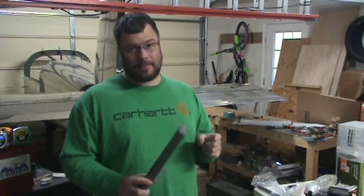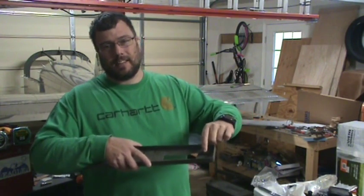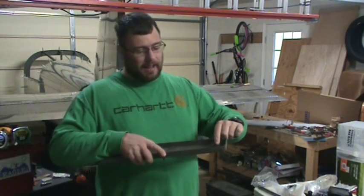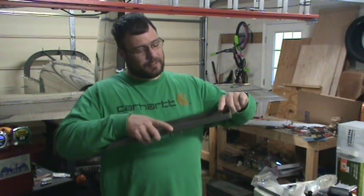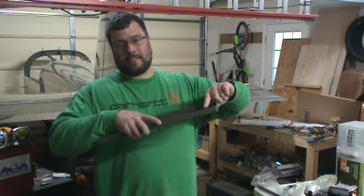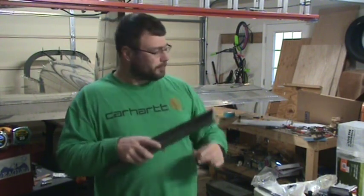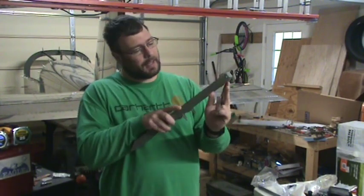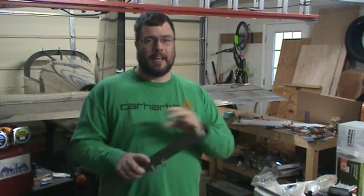And since I know my drill bit is going to shift on me when I'm drilling this hole that is the location of the axle, we want to make sure it's not offset and at an angle, which would cause the cam to be in there crooked and everything to end up not parallel and a whole bunch of binding to occur.